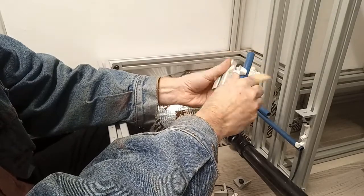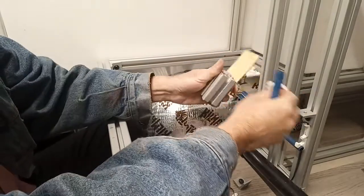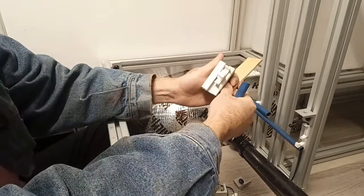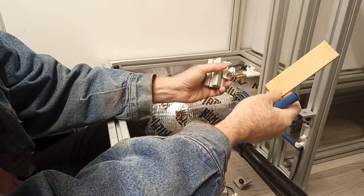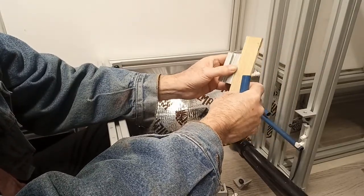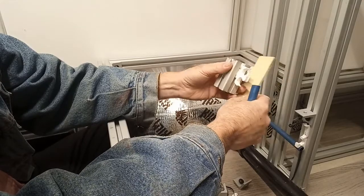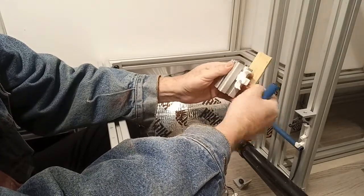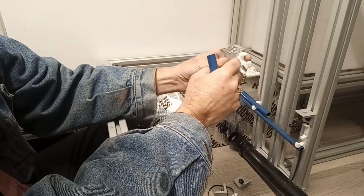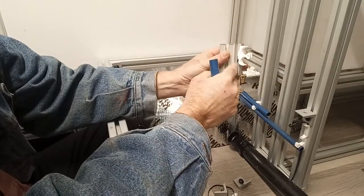I also developed it so that in this orientation, if you've got a three-quarter inch panel or a five-eighth inch panel, you can put it here and it'll sit flush like that. You've got room for a screw hole, a screw coming back. And there's actually a little shoulder in here that creates a sixteenth inch gap.